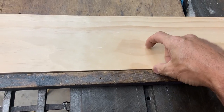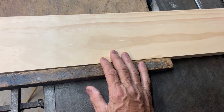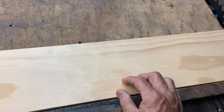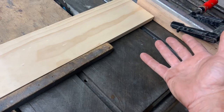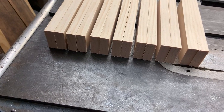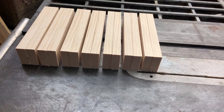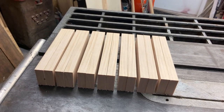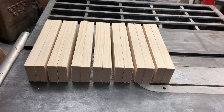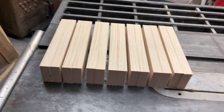I'm going to rip this to 2 and a sixteenth, get 2 pieces, then turn my table saw 90 degrees again. That'll give me a usable full-length piece I can use for other parts. Then we'll set up again to cut the 8-inch long pieces. I've got some people over right now picking up the old wheels from my bus — I gave them the old wheels. The tires are too old to use but they want them for some semi-trailers, and the rims are good. So I've got to help them out, and hopefully I'll have time left over to come back and glue these pairs together.